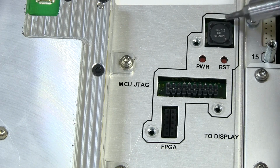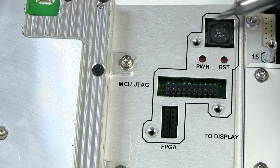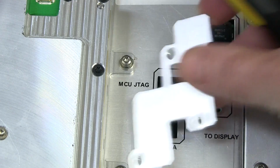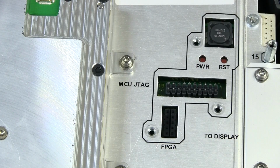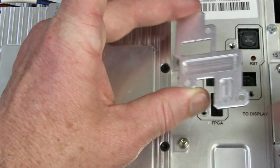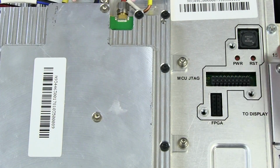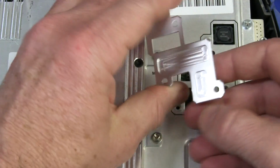Obviously it was too high to get under the main cover. So they went, oh bugger it, let's just put a little cutout in there, and then we'll put the plate over that. It'll all be nicely shielded anyway. Beautiful. But check out that. Even the plate, they've had to machine out a cutout in there so it doesn't short out the pins that actually aren't flush with that. Those pins actually stick out a little bit there. Just attention to detail.